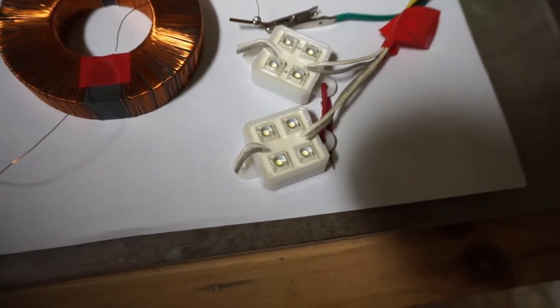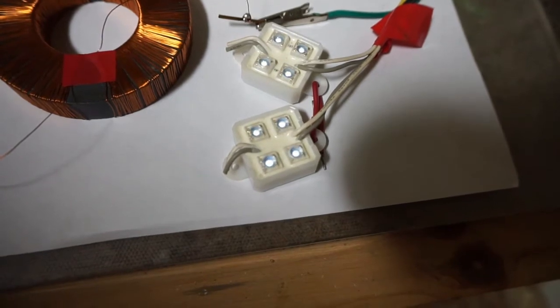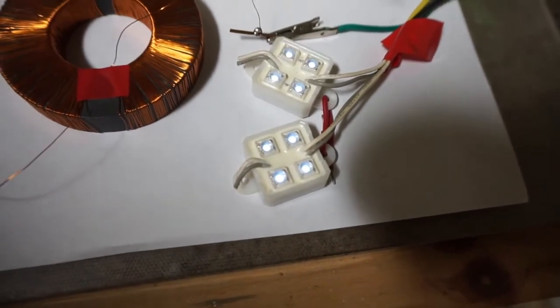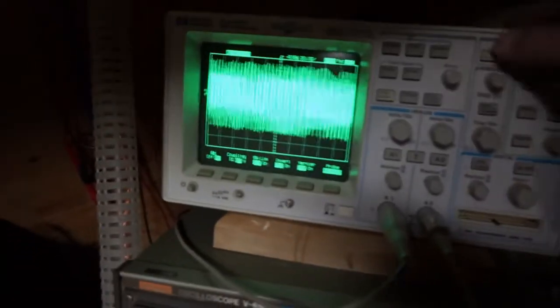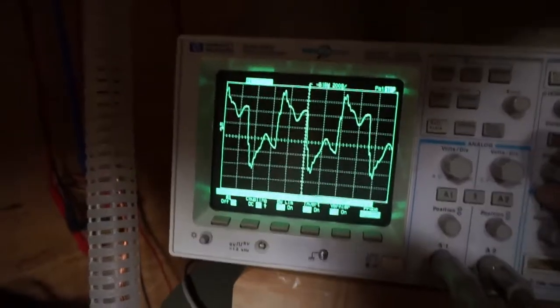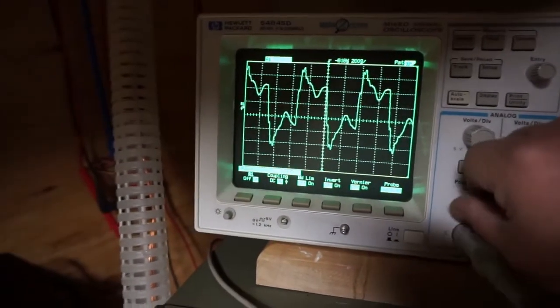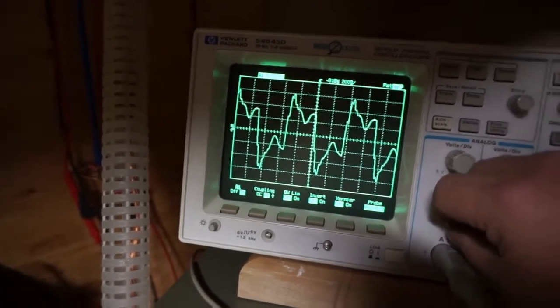I'm going to try another range, coming down from 11 MHz going down. I'm getting some activity so we'll stop there for now. Right now I'm at 1.40 MHz — I'm pulsing at 1.4 MHz here and picking up a signal. I'll freeze that and open it up. You can see that's a 2-volt divider. If I put the lowest end to any of the lines — 1, 2, 3, 4, 5, 6 — about 12 volts peak-to-peak.